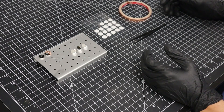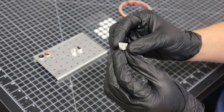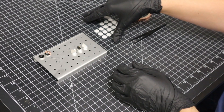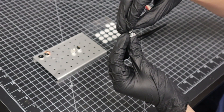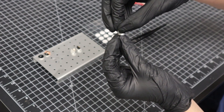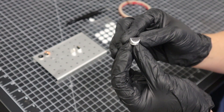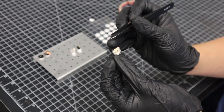Other stub variations can provide the ability for more specific analyses. One of the most popular varieties is the 45/90-degree stub, which allows operators to image cross sections or the end of long cylindrical samples. To prepare a sample with this mount, we begin by applying our carbon tape over the top edge, drape it forward, and then use our tweezers to remove the white backing label. Now we can mount our sample accordingly.